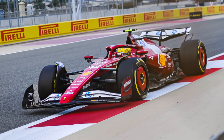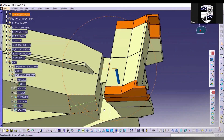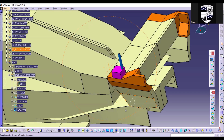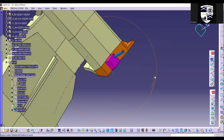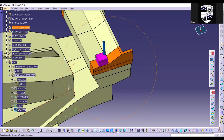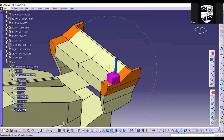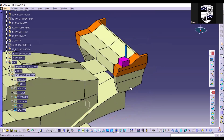To apply this load, each team needs to provide an adapter which fits to their wing. It needs to lie between 490 and 610mm laterally from the center and have a maximum area of 15,000 mm². Teams want to spread the load across the wing as much as possible to avoid too much deflection, so they will take the largest area. That means the length must be 125mm to reach the maximum area. The teams can decide where they position the adapter in X, but since the force is applied at a defined location, there is not much variation.